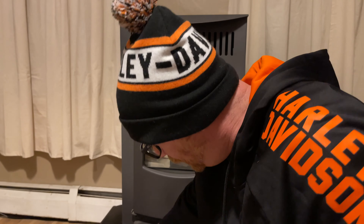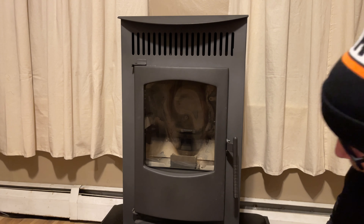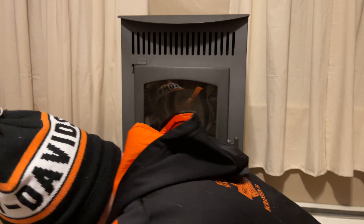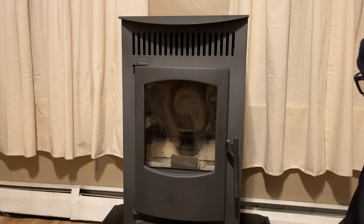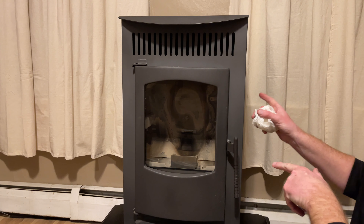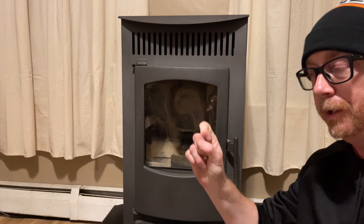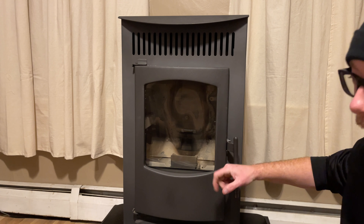I have this sitting on a six-inch lift with a stove board — the lift was made by a friend of mine who does woodworking, Bravo Alpha Woodworking, you can find them on Facebook. It's vented out the back with the dura vent. They recommend once a week go out to the dura vent — the bottom part comes off, dump the ash, put a leaf blower up in it and just hit it. It cleans it right out. Make sure your door is closed when you do that — learned the hard way. Left it open and came in to dust everywhere.